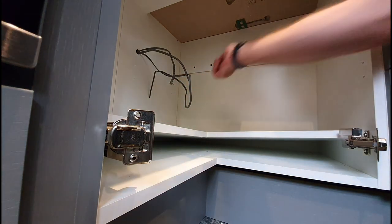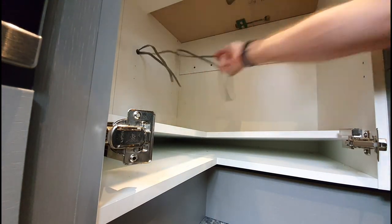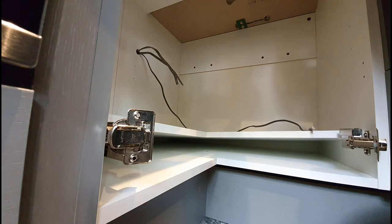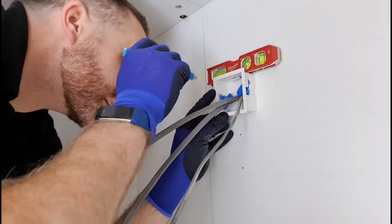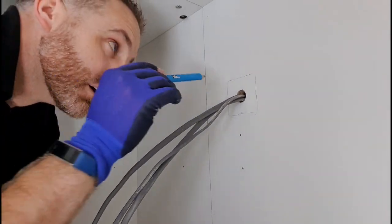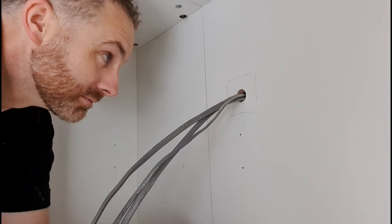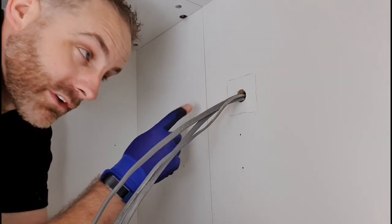It's out of the way at least. Now we're going to find out what's going where and run the cable. Just putting one of the boxes on to make sure it's level, pencil it all around. I'm going to cut out with the multi-tool and open up the hole. We can then go fishing for the infamous 6mm. This box is for the hood, another one for the oven, and another one for the hob itself.